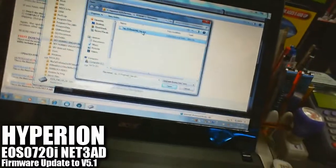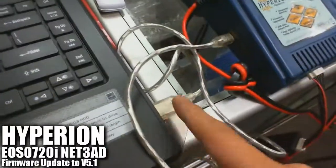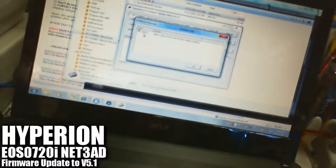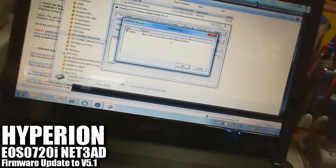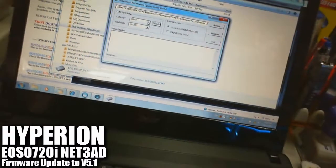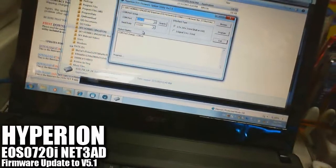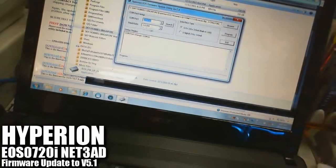Click on the bin file and do a search on your COM port. When you connect your USB into your computer, the utility should be able to auto-search. In this case it says COM 16 — it detected at COM 16. So what we need to do is scroll down to COM number 16 and leave the baud rate at 115200.